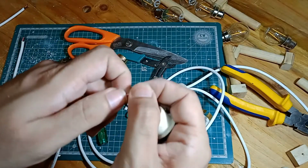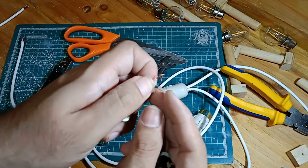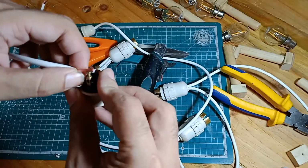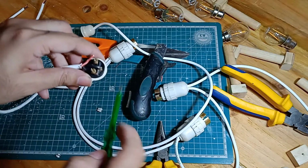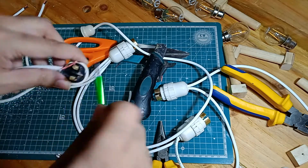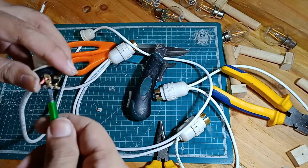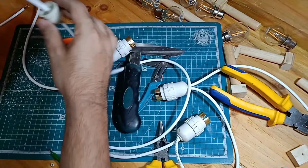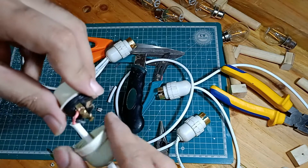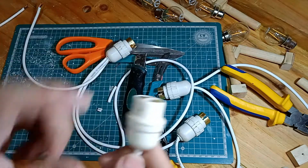and again, because there's a single conductor, I am not sure whether there's enough material for the screws to get a hold of. So what I do is I fold these over. This one goes in here, and because this is AC and you're not going to have any switches here, it really doesn't matter which side it goes to. Okay, and as before, you can, oops. So that's my supply.